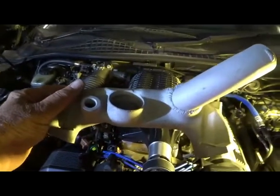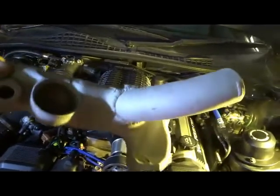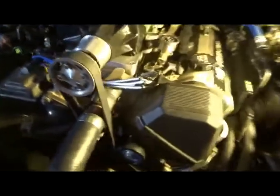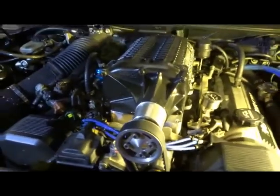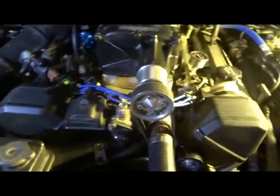This is a modified manifold supplied from Bullitt Cars. As you can see, the outlet comes out at about 90 degrees from the side, whereas the original outlet comes straight at the front, which causes an issue with the supercharger — the belt gets very close. I've put a piece of pipe in there to clear that, but this modification will take the belt right out the side, bring it across here and back into here. I'm going to do a video on installing one of these.